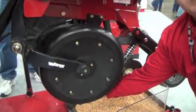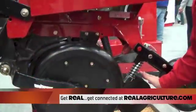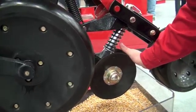We have a forming point that follows the opening gauge wheels. It's underneath here, but it's a little tooth that just guides itself through the seed trench, keeping it clean. And by so doing, the seeds are all able to be placed at a consistent depth in the seed trench. Now comes the way to close it up by protecting those precious moisture resources in the seed trench. And we do that with these double reverse disc blades right here.